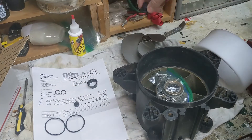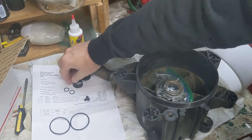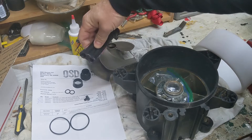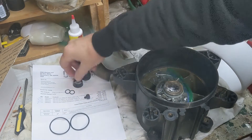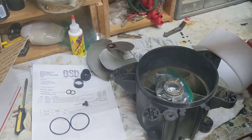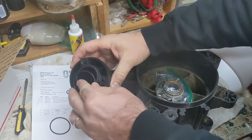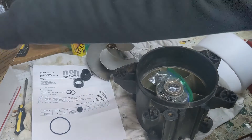We've also got our new little rubber boot that goes in here in the impeller, a new collar that holds that in place, two O-rings that go on the nozzle part with the two little nipples for your bilge pickups, a rubber bumper that goes on the driveshaft — you actually need two of those. If you don't have those rubber bumpers in there, your drive shaft's going to be slinging around inside your pump. And then just one O-ring for the cone here.